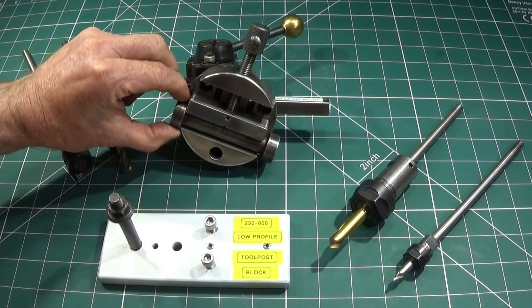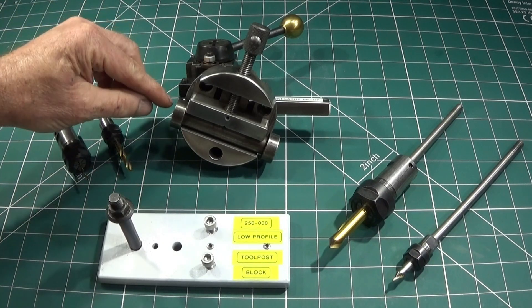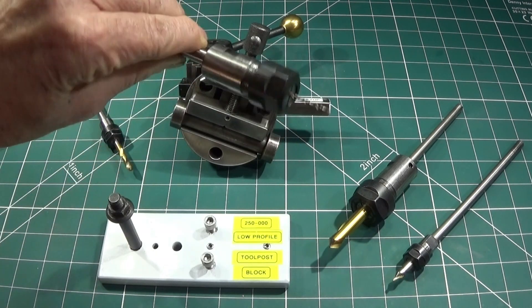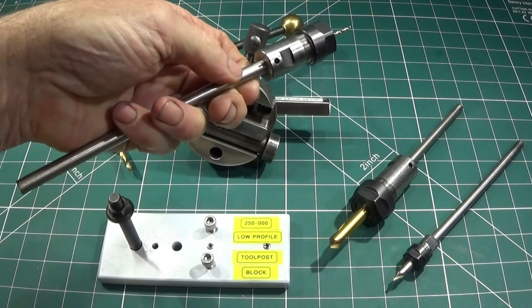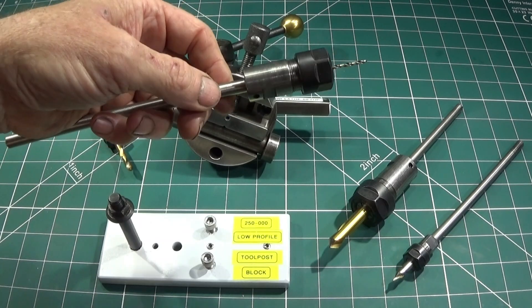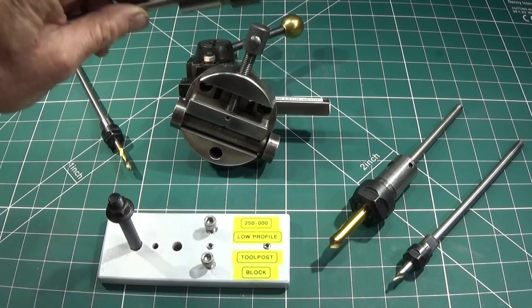These tool post drills are dead easy to make. I've got a bearing in each end of those, but you don't really need a bearing if you have a close-fitting spindle. The spindle size for my housing is 8 millimetre, and then I've got collet chucks of various different sizes which fit the 8 millimetre stainless steel bar. You can just buy a ground stainless steel bar and they push into these collet chucks and secure with a grub screw on the side.